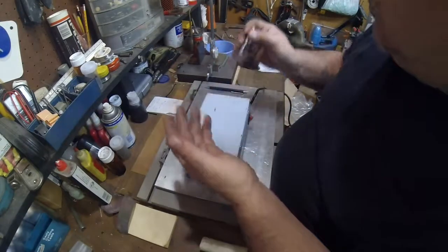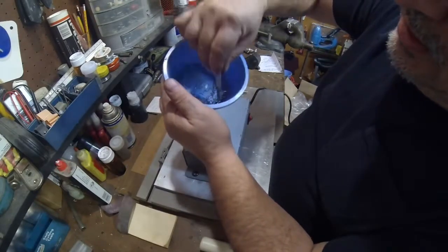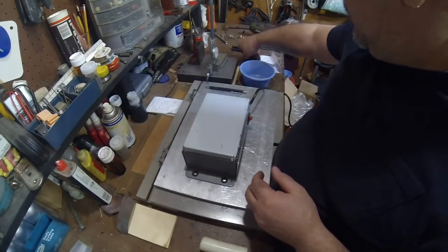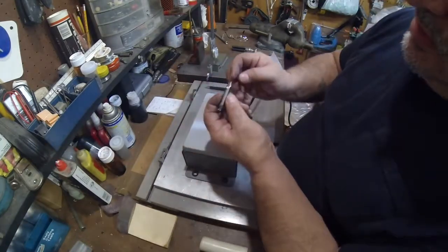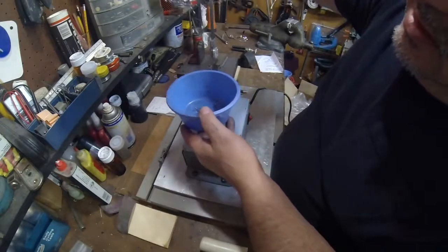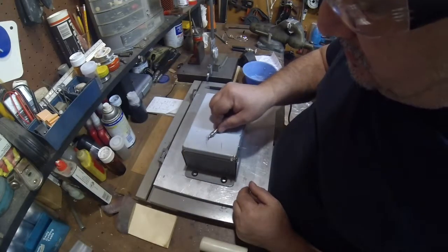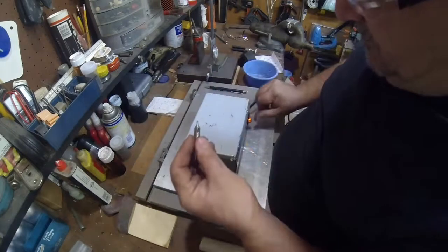Alright, it picked up a couple of chips. What I should have done was made it visible that the tool was magnetized, but you could see the chips falling right off of that. I have another tool here — a center drill. In fact, we're going to put that back on and magnetize it again. There you go — you can see the chips are built up around it. Put it in my bowl of chips and you can see it is definitely holding chips. Turn it on, hear the humming, put it on top of the platen, run it across, then shut that off.